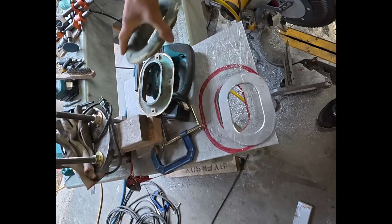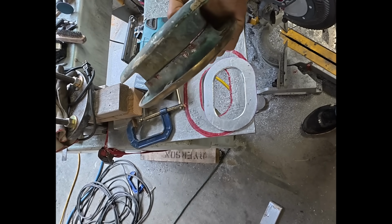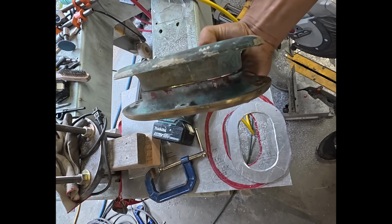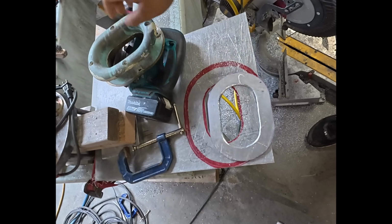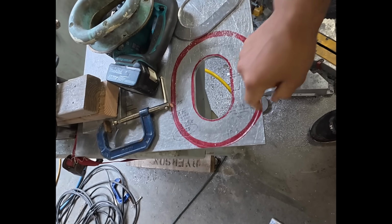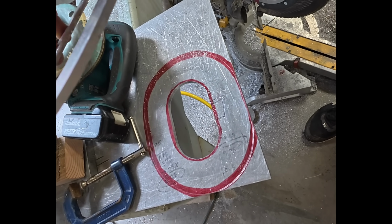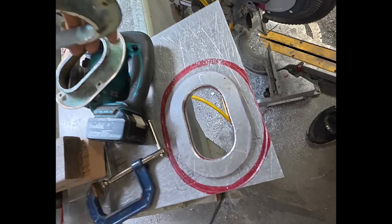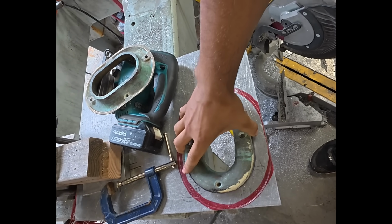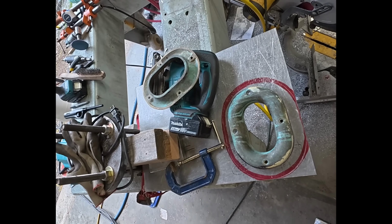The hawse hole components here. So we have the bronze hawse hole here, and you can see how much of a gap it needs in between the two faces there. So we're doing that with some aluminum shims. This bigger one is going to be welded directly to the bulwarks where you saw Dad cutting out that hole, and then just a slightly smaller one to make up for this little bit of slant on this unit itself. So I'll go in there, and yeah, it'll look pretty good once it's done.